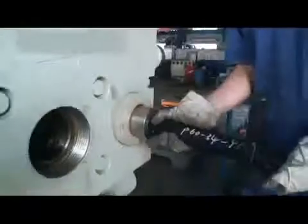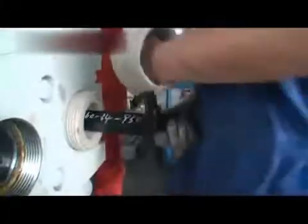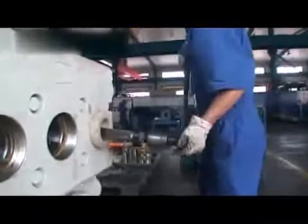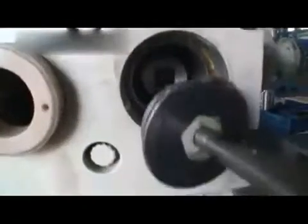Insert the plunger into the pump head. Continue pushing the plunger until the threaded ball approaches the crosshead stud. Tighten the plunger to the crosshead with the plunger wrench to achieve torque. Now we adjust the oil seal retainer as straight as possible with the plunger center line. Tighten the bolt holding the oil seal retainer.